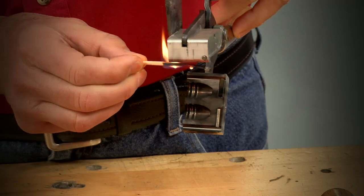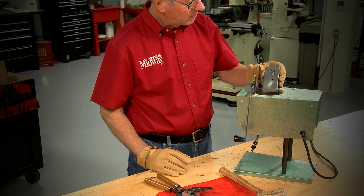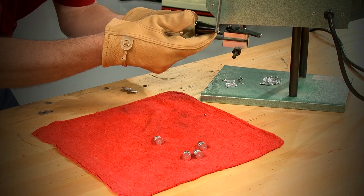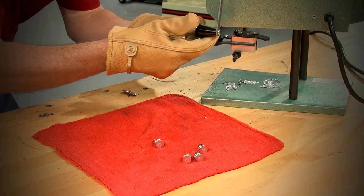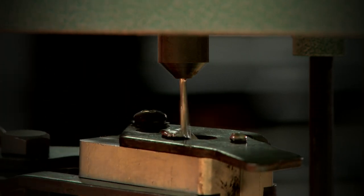A light film of smoke and it's ready to cast bullets. I'm using a 20 to 1 lead alloy — 20 parts of lead, 1 part tin. The mold is slid in on the rails and raising the handle on the casting furnace allows the molten lead to flow out and fill the mold.